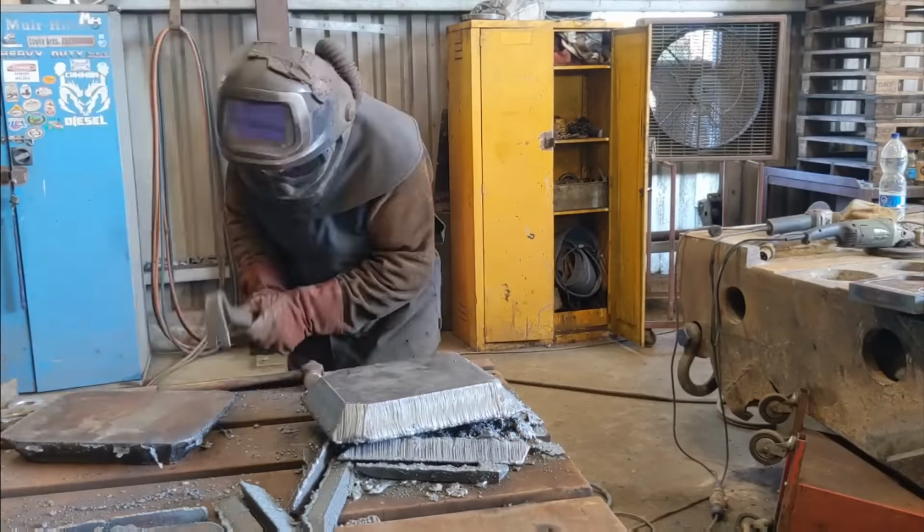So there we go, we've got a good replacement out of the store. Smear some lube on it. There we go, that's it onto the wire now. Two wire sizes on each roller. Make sure and get the right wire size on. There we go. Simple as that, we're back in action. Brilliant.